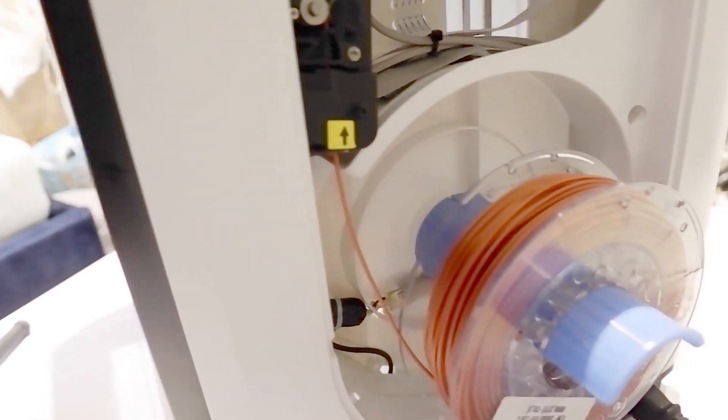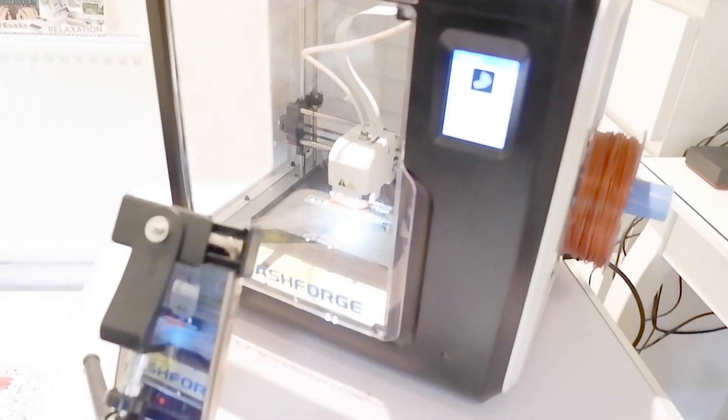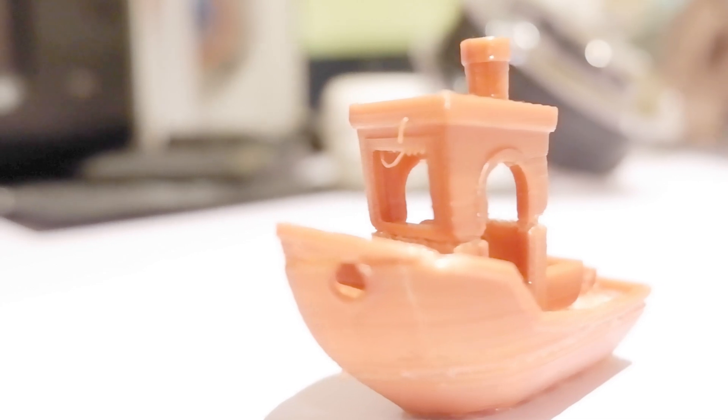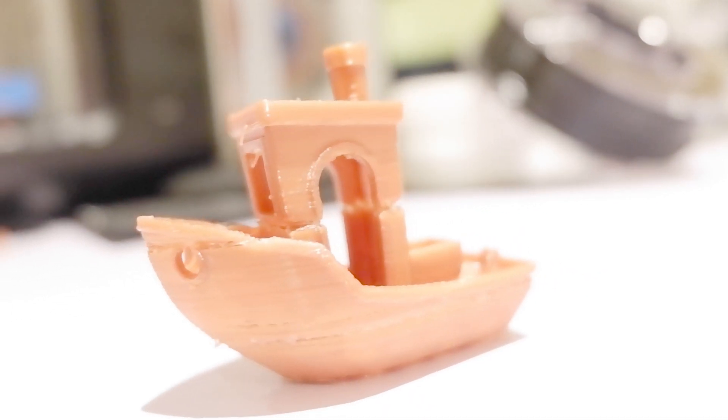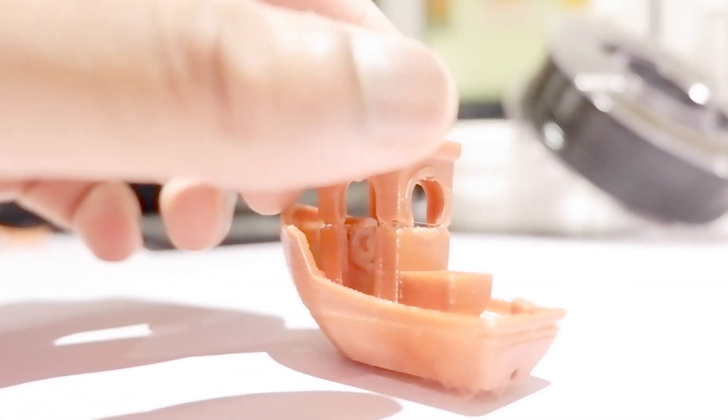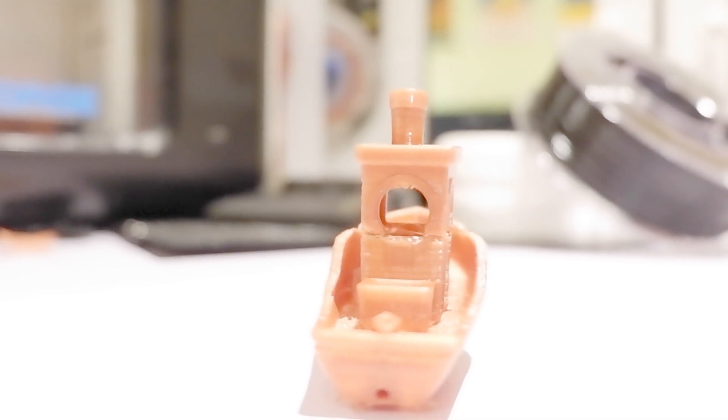Things did seem to improve when I printed a smaller 3D Benchy. But then I noticed, when observing the printer trying to print a larger 3D Benchy, that it would dip to about 130 degrees at key points within the print, then rise back up to 230, which created the layer shifts I see in my print. I realized it wasn't just the temperature — the print head was actually dropping to 130 at key points. I don't know how to fix this, so leave a comment down below if you've experienced this before, whether in Facebook groups, Reddit groups, or elsewhere.